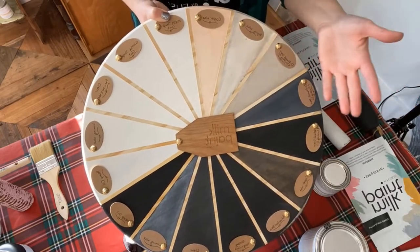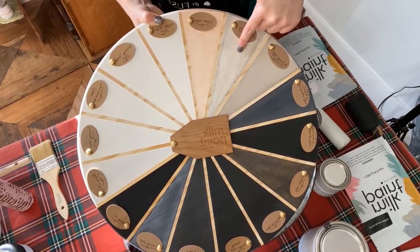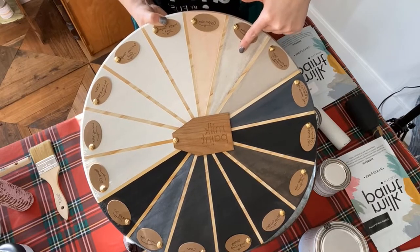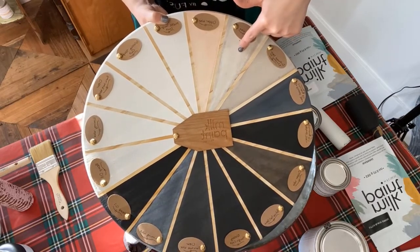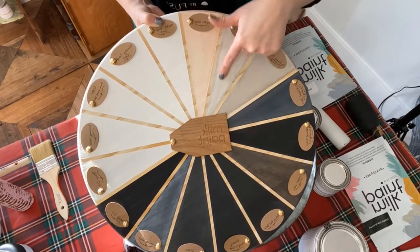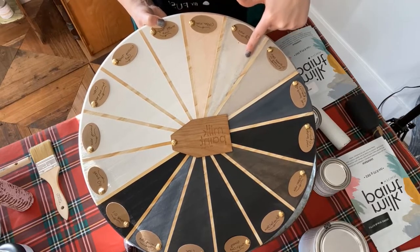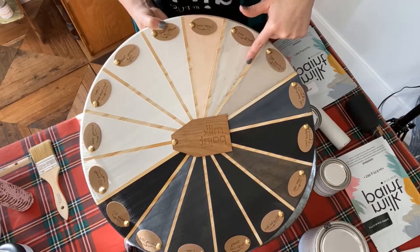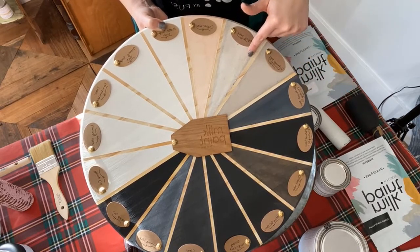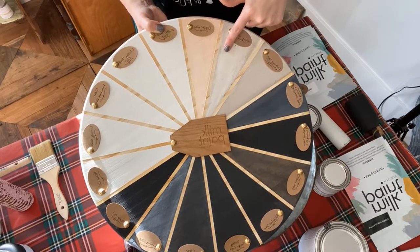All of the waxes are compatible over milk paint. Here I have aging wax over white. Aging wax isn't going to do much over a dark color, but over a white it can give a neat dark shabby-chic grunge look. If you have a piece with really cool molding, it can give a neat impact — that would be a really cool top coat option over a light color.